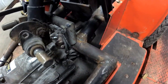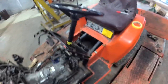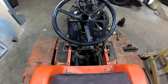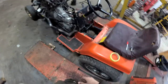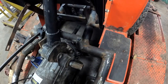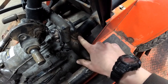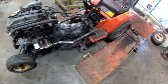That's tacked up. That's kind of how that's going to be. Steering wheel — I think it's pretty much factory position. It's kind of weird but it is off center from the factory. If you look at the dash, it's quite a bit off center. So tomorrow I'll probably take and actually center it on there, make the mounting plate, and then weld that to the frame. This is actually going to be welded at a different angle — that's just how I ended up mocking it up.